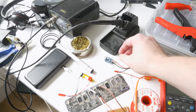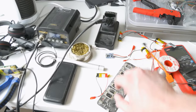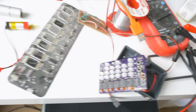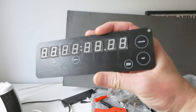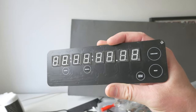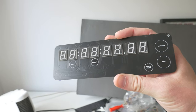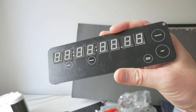TCP4054 or something like that. I can't remember. But I've also been picking up old projects that I'd started. Oh, look, you can see that. The binary crap clock thing. But I wanted to get this working again. Now, there is one thing, it mostly works. The only thing that doesn't work is when the minutes tick over, it doesn't increment an hour, which is a problem.